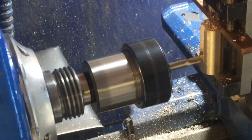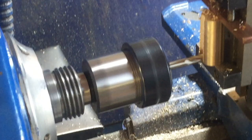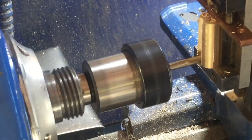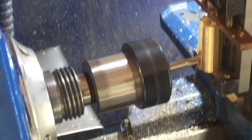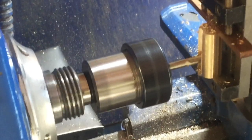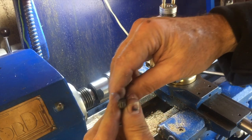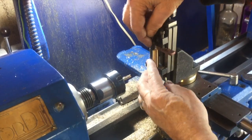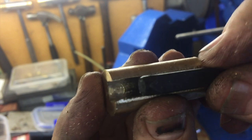There are two different ways the milling tool can ride on the work. If it's going over the surface like a wheel driving along, pushing down on the edge it's cutting, it tends to ride up over the surface — especially if you've got some backlash in your cross slide. It's probably better to have the milling tool turning in the opposite direction, undercutting the area. Trying one of the square punches in the slot I've just created shows it fits very neatly, coming up flush with the surface of the brass, which is what I was aiming for.